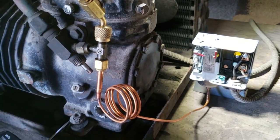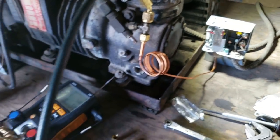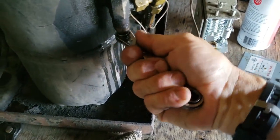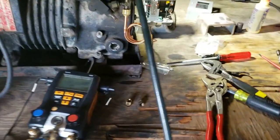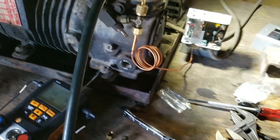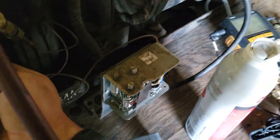So we got that all back in there. Got our tube on there — this is some really thick stuff so it shouldn't vibrate. Got it spaced out, put our oil on there. Let's go ahead and get this thing back up and going. That cooler is already pretty warm. Back that up one turn because you've got to have your high pressure fan so the switch can cut on there, and then crank that in a turn — it should make that run. Pressures are up. Go ahead before you get too far along and make sure that this thing pumps down correctly.